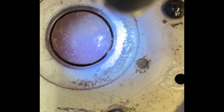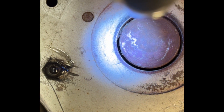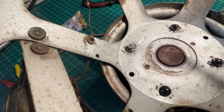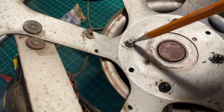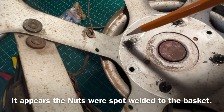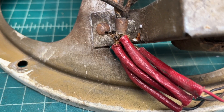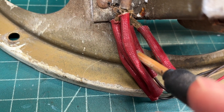A closer look at that magnetic gap around the center pole piece. You can see the iron itself has a little rust on it, and all the trash and debris that will need to be cleaned out around that area so we don't have a rubbing voice coil. Looking at the loudspeaker a little closer — one fastener there — you can see where somebody had tried to remove it in the past. I cannot find a socket that fits the nut. It looks like it's deformed where someone tried to remove it. You can see the scuff marks. Here's the strain relief I was talking about — you can see the wires, looks like a few of them are frayed underneath.